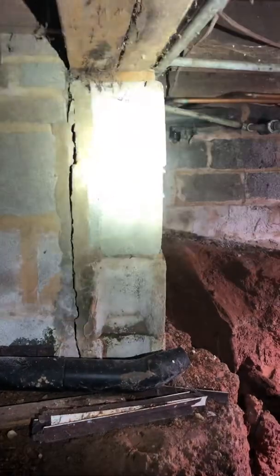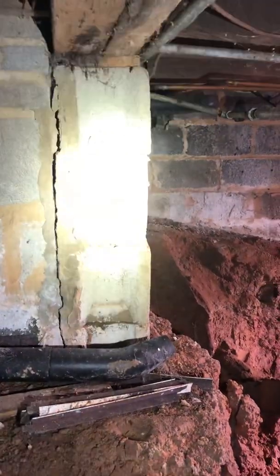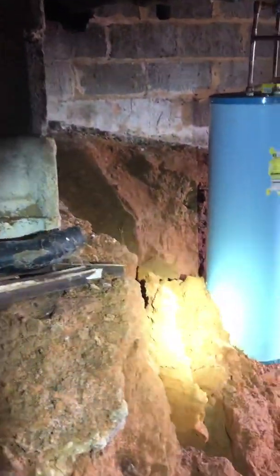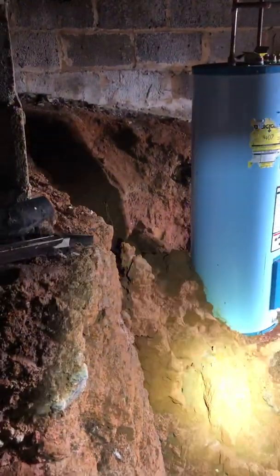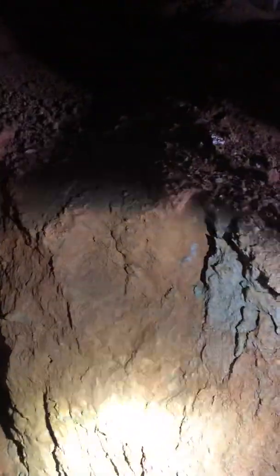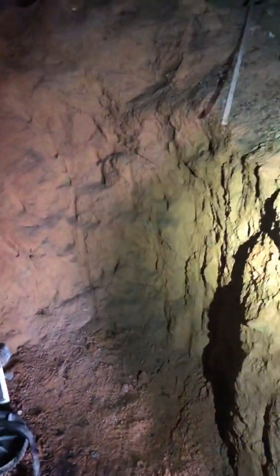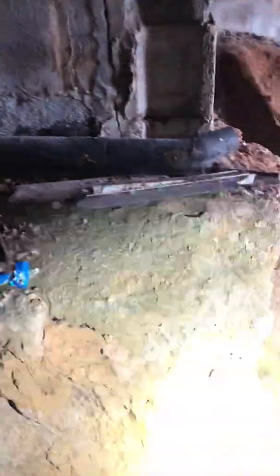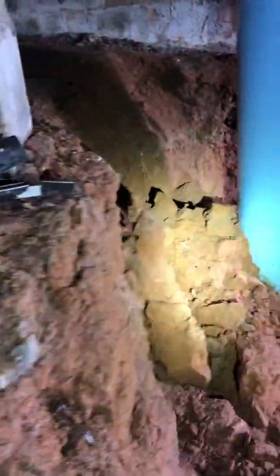However, this settlement needs to be looked at by a structural engineer. Normally what happens is they come in and put a buffer wall on its own footer and anchor it to the soil, kind of a buffer or retaining wall, so that there's no disruption in the soil again. That's what we're seeing around the columns. You can see the same thing going on over here.